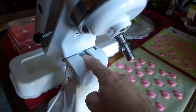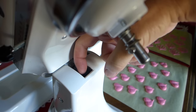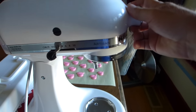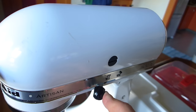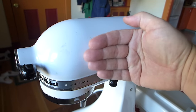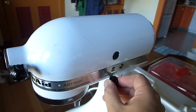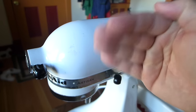This is a stop. When you move this head forward, that screw bumps into this surface right here. So by adjusting that screw, you can adjust how far forward this head comes. That also adjusts how tight this lock will be when you move it forward into the lock position. If you screw that screw too far out, this head will be up too far and this won't come all the way forward. If you screw the screw in too far, it allows the head to drop down too much, and with this fully locked, there's slop in it.